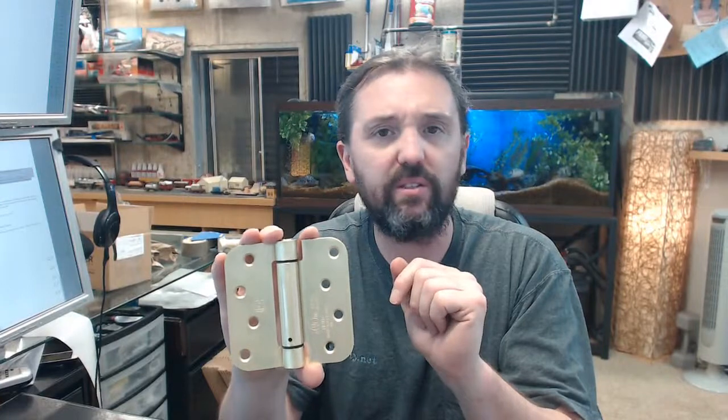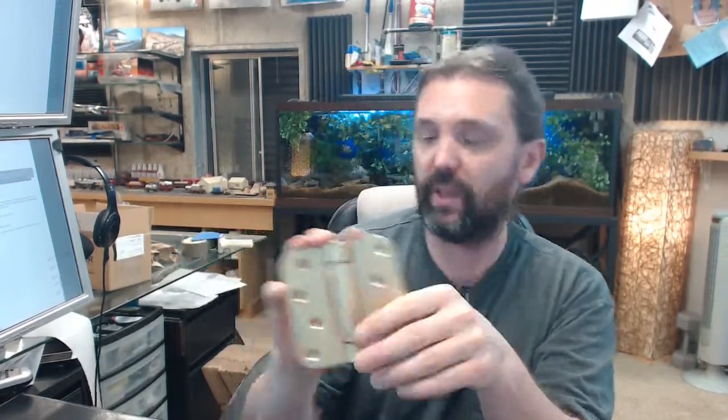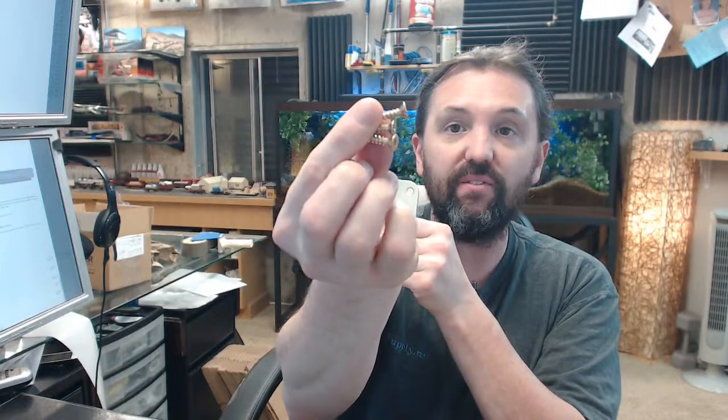Or when it's automated, it makes more complicated the manufacturing process. So 5/8 radius is real common. With a 1.25 inch bit, the amount of passes the tool has to do to create the hinge prep are minimal. Anyway, enough about that. You can see where all the screw holes are. Screws are included. There'd be obviously 8 of them, 8 wood screws for this.